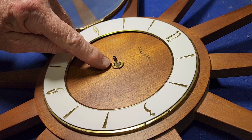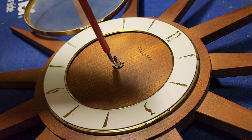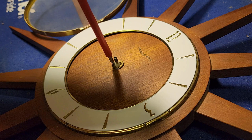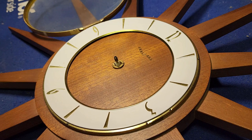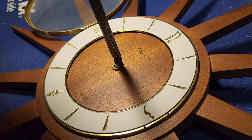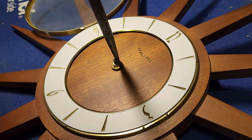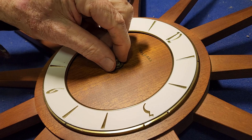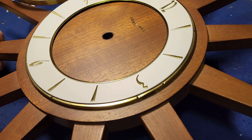There's a retaining screw which has a slot on each side. Usually a decent wide flat blade screwdriver will undo these — they're generally not tight, and generally they have a piece of rubber or something insulating between the clock movement and the back of the clock housing. We needed a bigger screwdriver — the larger flat blade sits in the slot and gives us enough leverage to turn the nut. No slippage means no marks. That should be all that's retaining the movement and we should be able to lift the housing away.